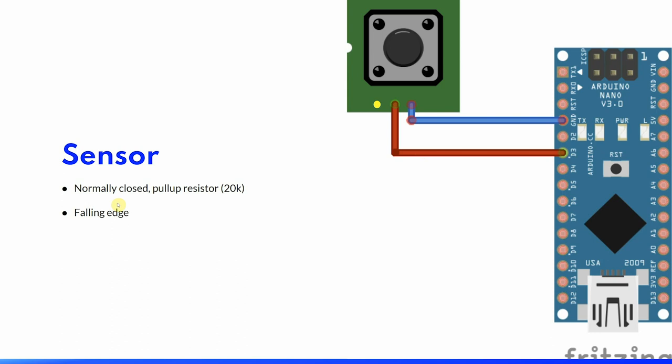Following this, the pin will be in high state and still nothing is happening. The microcontroller is still in sleep mode. But when the mail is deposited and the lid is closed, the pin with the microswitch will enter falling edge and this triggers an interrupt. This leads to the microcontroller waking, measuring the battery, sending a radio signal, registering a new interrupt, and going to sleep.